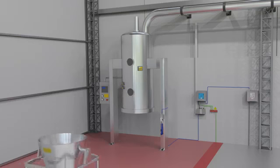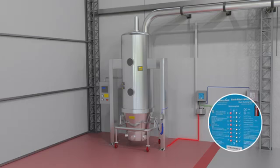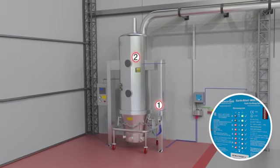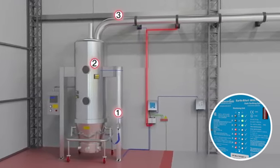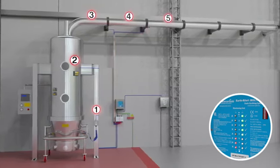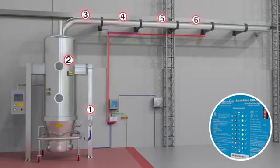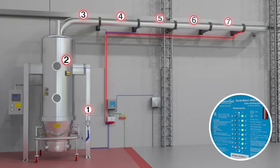On fixed plant equipment such as fluid bed dryers, sieves, silos and powder conveying systems, the Earthrite MultiPoint may be required to ground and monitor multiple parts of the process plant which could be at risk of isolation. The Earthrite MultiPoint will detect if one of the monitored plant items has become isolated at any given time. Isolation could occur if a bonding strap, clip, gasket or bonding cable has been misplaced during reassembly — this may happen without the knowledge of the operator prior to any clean-down operations or scheduled maintenance.